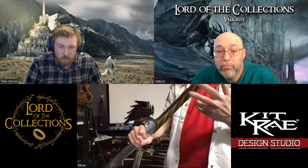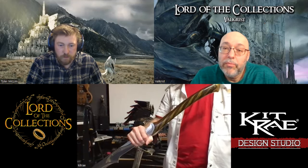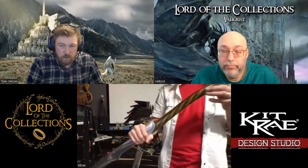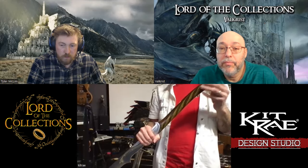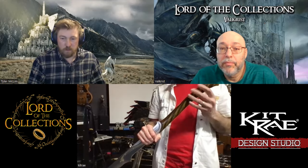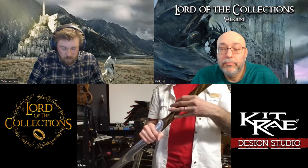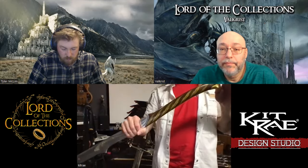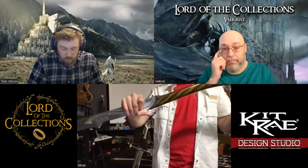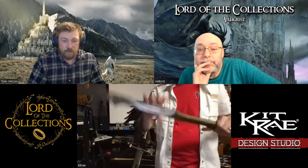The one area that we will have to make a compromise is that's not going to be wood. I'm sure you guys have some of the originals, the old versions from when United did wood handles, but it's getting harder and harder to get consistent wood, to get the shapes consistent. The R1 sword is one that's pretty much on the chopping block right now. That's going to be changed to an injection mold, and it'll be a water transfer type of decoration for the wood grain with a kind of thick lacquer over top of it like this. But that's the one area that I have to get worked out, to make something that's going to look as real as this, obviously. This is a plastic handle too, but I don't know if we can get it that nice, so that's one of the hurdles that has to be worked out.